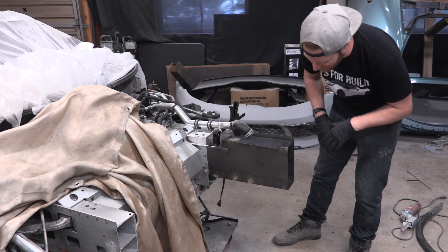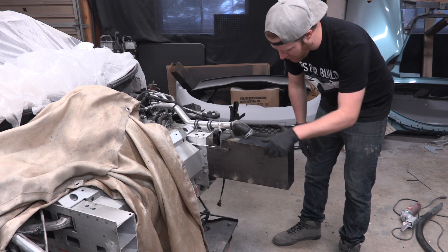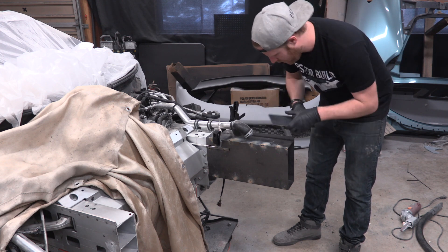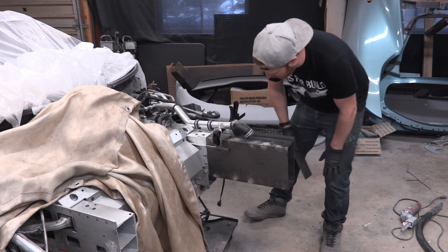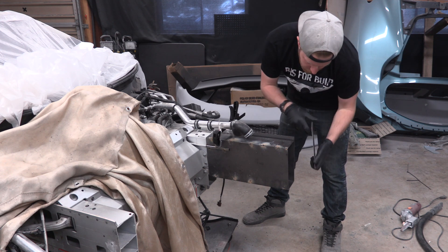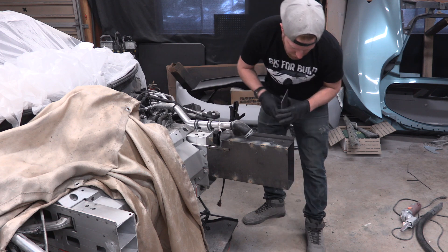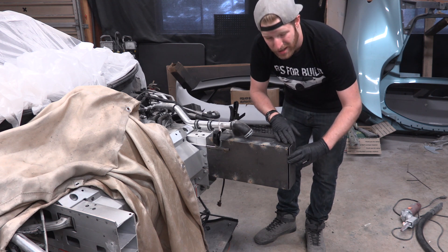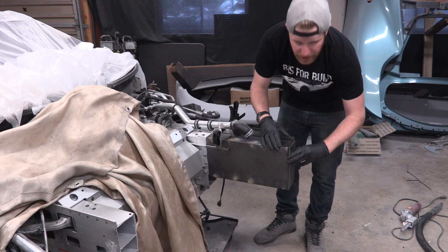The stressful part is complete — both of these fit on here and they fit well. That was the hard part done. Now we just need to button it up. We've got these plates that need to go on the front, and then we need to build something that can go over this little rail lip. Right here we have an option: we could weld in something that covers right here, or we could go over the top of it the whole way. It's going to be really hard to cut that one-inch square bar to size all the way around and cut it straight. But first I want to go ahead and weld in these end caps. I've got it clamped up nicely where it needs to sit, so I need to squeeze it in just a little bit and find a way to get this thing to sit in the right spot.